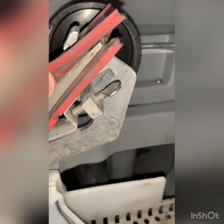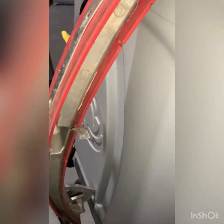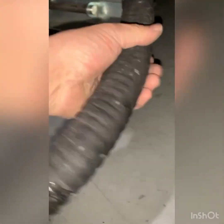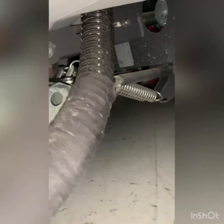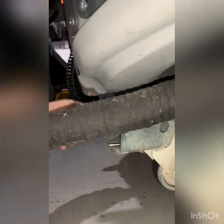On to the squeegee: the blades have been rotated on the bottom side, and generally it's fairly clean. We would probably want to flip these and have a spare set ready. I'm not sure if they've been flipped completely 180 degrees — there's debris stuck in there. This is how we mount it in that notch and lay the squeegee. Also, there appears to be damage to the hose — looks like it's been repaired with cloth-type adhesive, which I don't typically see.